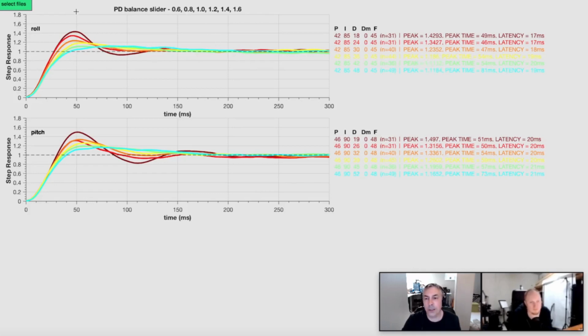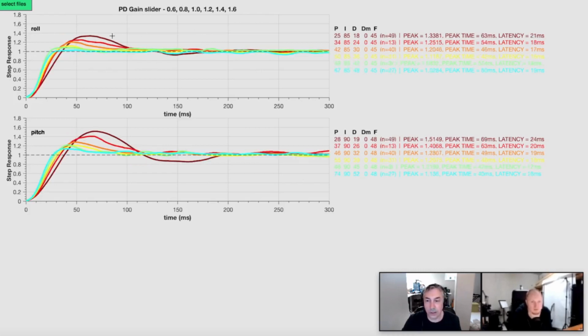So this is why I wanted to pull away from the idea of saying that people should start by tuning the P to D balance. If you don't have the gain high enough, you're going to sometimes get these low overshoots here, and people are going to think, well, what should I add? If I got overshoot, I should add D, right? That's the general assumption in the field, and they're going to make a mistake there. If instead you start with your gains, you're going to already see in some cases that by just cranking the gain, you'll start to see this peak going down. Now, if this peak doesn't go down with gain, then maybe your gains were already good and you should go to P. But this is the place to start.